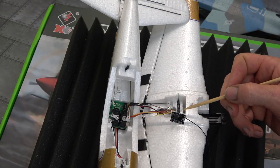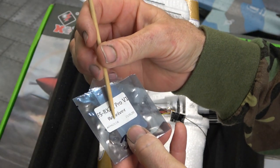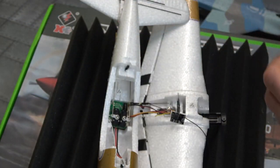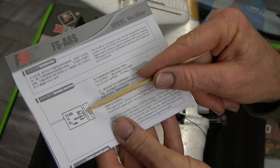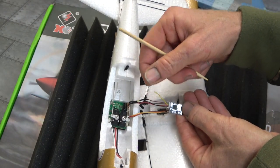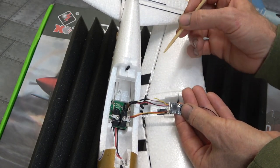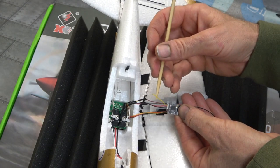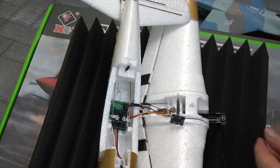Here's our Air Bear — I've wired in a slightly cheaper receiver. This one uses the same protocol as the FlySky — the AFHDS 2A protocol. It's a cheaper receiver and on the website there's no wiring diagram, but it is wired the same as the FlySky receiver, which is good. For some reason we don't use the SBUS yellow wire here either — we have to use the PPM brown wire. The black one is ground and the red is power. You don't use that SBUS wire — got to use PPM. Plugged in the back port, all plugged up and ready to go.